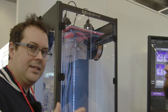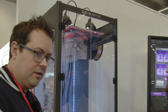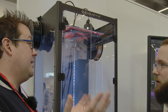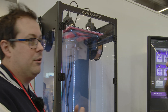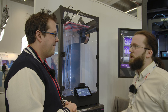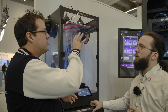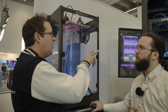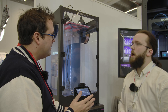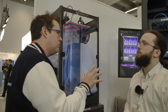The thing to remember is that a top speed is exactly that — it's not necessarily the speed every material will achieve. A lot of print speeds advertised in FDM feel like marketing terms. In theory you could do 1,000 millimeters per second because the motors will let you, but you won't see 1,000 mm/s on our data sheets. The speed entered in the slicer is what you'll always see — 400 millimeters per second with PLA will be on the slicer. The smaller machine is 300 x 200 x 270 mm — still a really good size, with the same tool head, auto bed leveling, auto calibration, and runout sensors.